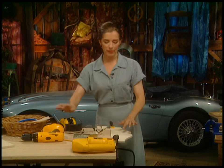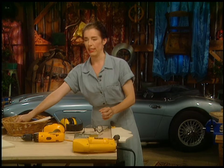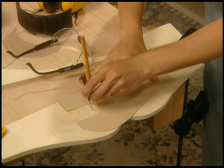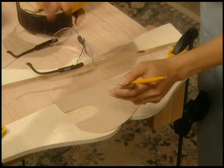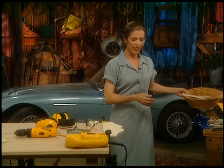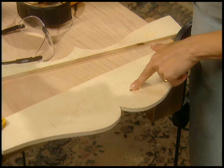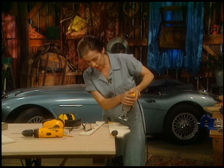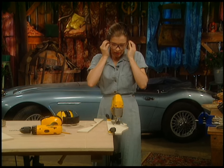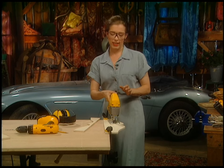Also make the handle nice and big. Don't do a half-inch radius when you draw it on your paper — the radius is what gives you that little round bit at the end, and half an inch is too small. Go a bit wider because you want a big ham hand to be able to get through. To do the inside cut, use a jigsaw — start a hole for the blade, insert the blade into the hole, and you're off. Go slow with your jigsaw and you'll get less tear-out.